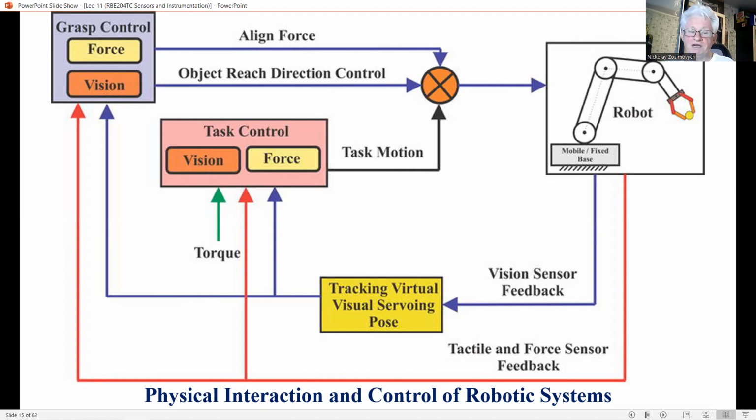This is achieved, for instance, by mounting the camera on a rotatable platform. The orientation of the camera is controlled in such a way that the spot is always in the center of the image. In this application, a 2D PSD camera is a good choice because only a single light spot has to be detected. Since the spot is always in the center, errors due to the nonlinearity of the PSD, occurring mainly at the edges of the device, are limited and eliminated. Encoders on the axis of the platform provide the information about the light source position.